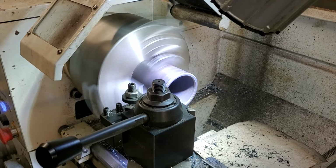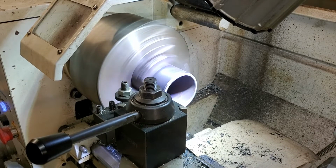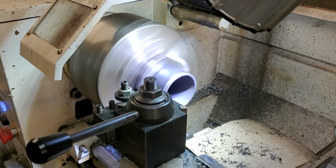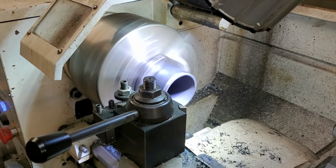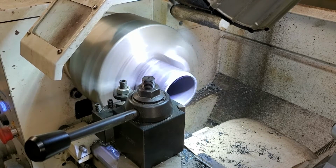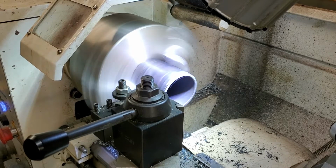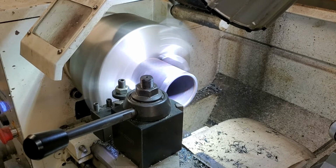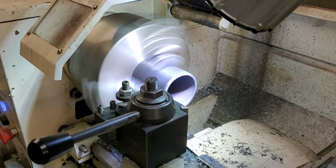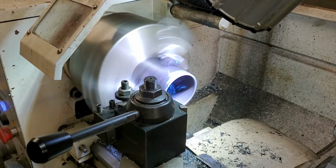And first, I'm gonna ease it in. I'm gonna take a little bit. This is a piece of pipe I use for something else. So there we go. I'm gonna ease that off. And I'm just taking a little bit off right now just to find out how centered up I am. Make sure everything is nice and tightened down. Here shortly I'll be able to take off more of a product. And that looks pretty good. So I'm going to back up here and remove the amount that I need. Now that's nice right there.